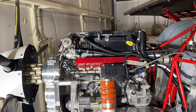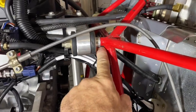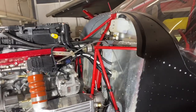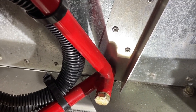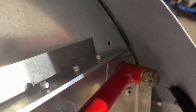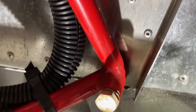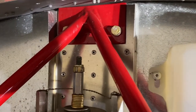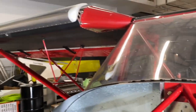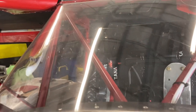You want to put a level on the engine and then a reference line on the airplane, and just level the engine. This engine mount needed some spacing. The corner bolts are exactly like the Zenit 750 videos — this is still a Zenit 750 airframe, so watch all the videos pertaining to the 750 installation. Bolts go through and there's a lock nut on the back side. Sometimes on the bottom we use an MS nut because there's less room against the floorboards. Do the top last, then center it — especially if you have wings already on the airplane — because this will straighten or make your airplane crooked depending on the V-shape in the window.